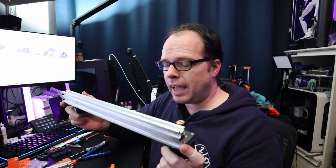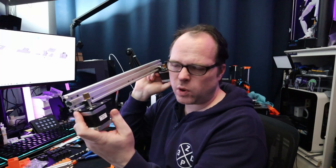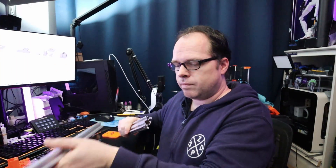So like mentioned, this is the Y axis with the two stepper motors on it. These are on brackets from the Creality Ender 6 - I had them laying around, very perfect. It's not going to be the official spot where I attach the motors to. They are going to be closer to the base for the Z axis, because it is called Z Core - so everything is very close to the Z axis. Core XY system, cantilever, everything compact but still having a very cool movement. So with what I did in Fusion 360, I designed this little bracket.